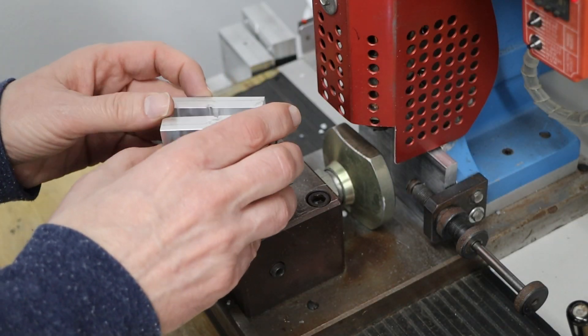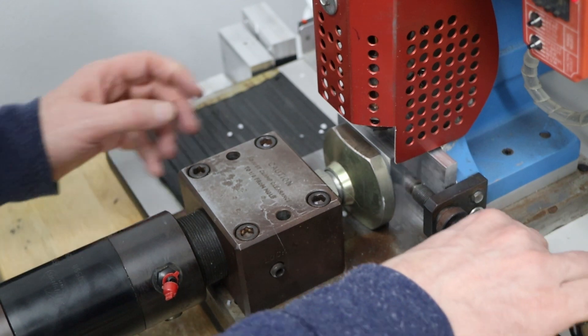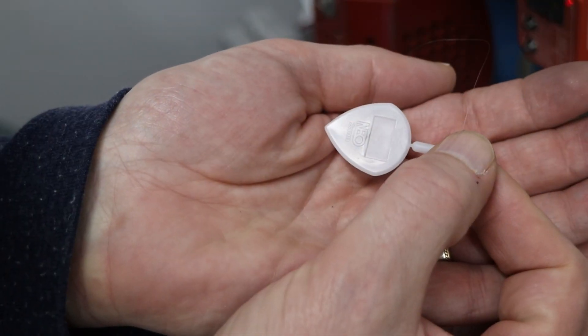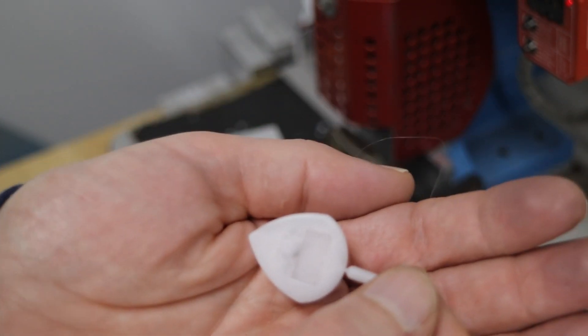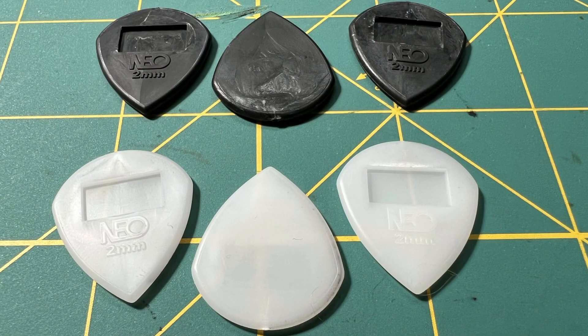I'm using some white Delrin for this test, after previously using white polypropylene and then black ABS. You'll see there's still a little bit of black ABS — I haven't completely purged it. This sticks pretty well because it shrinks a little, so I use a knife to pry it up and it comes away fairly easily. The details are pretty easy to see — this is kind of what it looks like to your eyes. Here's a close-up showing the polypropylene and ABS together. I didn't dry the ABS, so it has a lot of streaking, and that made it rather brittle. That was a fun project. I'm going to have a clip of Justin playing with one of the picks I sent him. I want to thank all of my Patreons. Please help me grow the channel by subscribing, commenting below, giving me a thumbs up, and I'll see you next time. Thanks for watching.